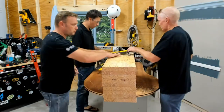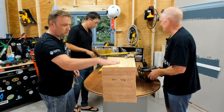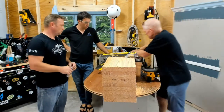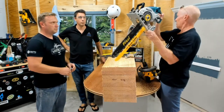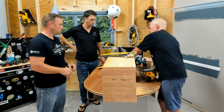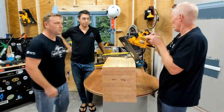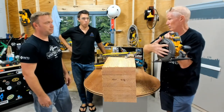What's the difference between a worm drive saw and a regular saw? A worm drive saw is a heavier duty saw — it's heavier to handle, the blade is on the left-hand side. A standard circular saw is lighter weight, doesn't quite have the same power, but it will work with the beam cutter — and the blade is on the right-hand side.